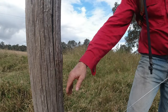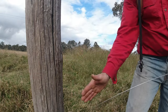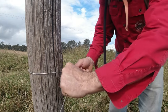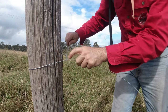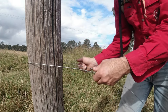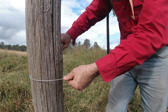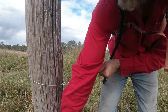I know I'm going to be tying off on this strainer post. What I want to do is make up my wires for the insulators to go onto here, that way they're not going directly around and earthing out on this post. So just a simple termination knot — you just always cross over the top of the wire. Keep tension on this wire, go over the top, keep tension pulling it down and pull it straight back. Come up — and that keeps this area tight. Now slacken that wire off and feed the tail back inside against the post. Pull it back on. So now with that wire inside the loop against the post, keeping the tension on it, pull it round 180 degrees and then back straight up 90.